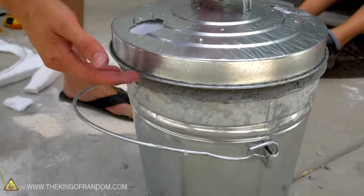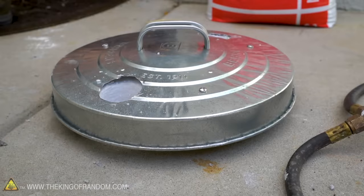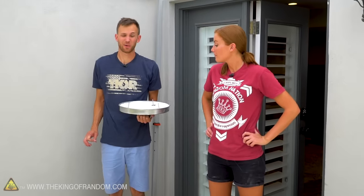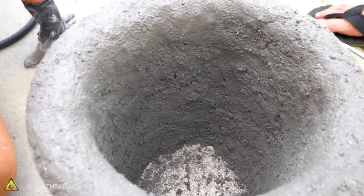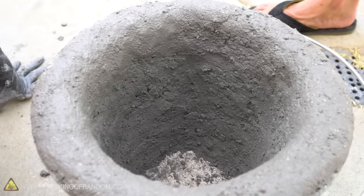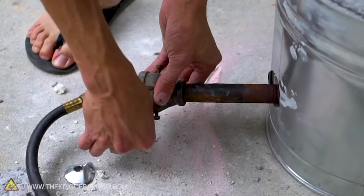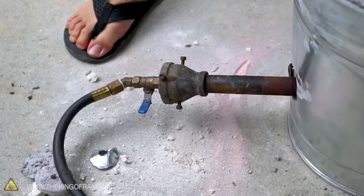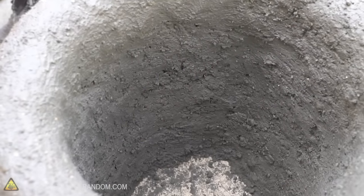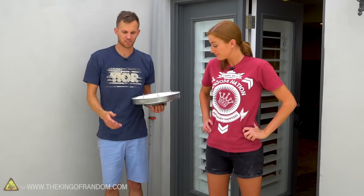The kaowool is resting right on the cement, so that should be giving us a pretty good seal. These are our gaps — that's where the air comes out — perfectly positioned. Our screws also work as little feet to keep it up off the ground a little bit. We want to make sure it's good and cured and then we have to do a slow heat. You may have noticed there aren't holes drilled into the foundry yet — we've made sure we know just where the bricks are so we'll drill those same holes using our hole saw once it's cured, cutting through the metal, brick, and concrete all at once. We'll hook the propane up, maybe just turn one burner on, and slowly get it heating until we can get this to cure nice and evenly. A lot of water will evaporate, but chemically there will still be water inside until we heat it up to that higher temperature — we have to get there slowly so it doesn't crack. Now it's time to just wait.